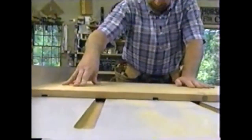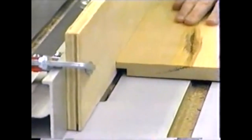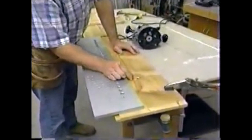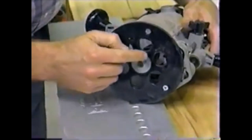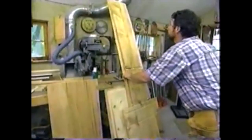I'll back the fence off for the next dado. I've installed a sacrificial strip on the fence and slid it over next to the blade to make a rabbet for the top of the cabinet. With a couple of adjustments — raising the dado a bit higher and narrowing it — I've made a rabbet along the back edge to receive the backboards and back plywood. The upper section has adjustable shelves, supported by these clips. This jig cuts a series of holes an inch apart — I clamp it in place, set my router with a collar into the large hole, and plunge it down to get a quarter-inch hole for the clips. That takes care of the sides.